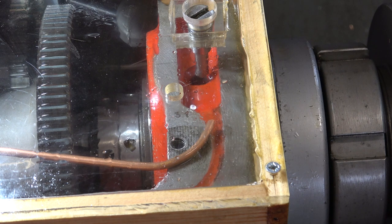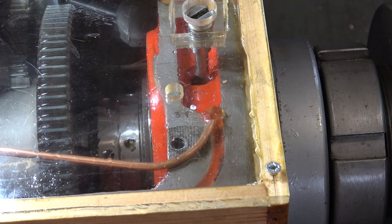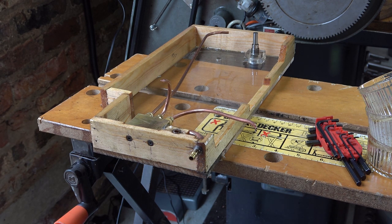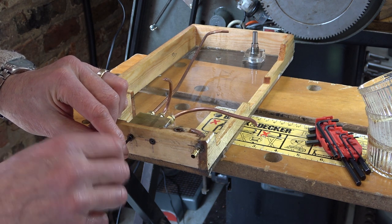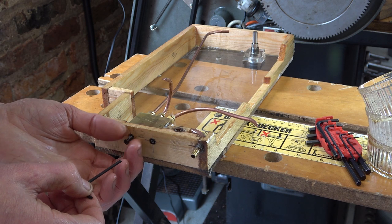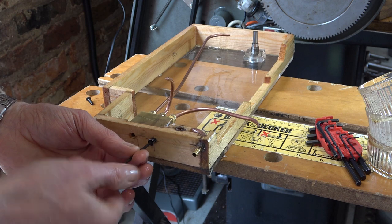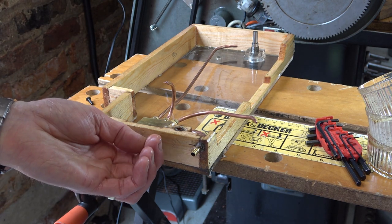One final test with the transparent lid now that the pipes are balanced with the gear pump — we'll see how much oil we get out of this front nozzle. I did have a look to see how long a tube in a peristaltic pump should last, and I saw 10,000 hours, but those are for the proper ones. I don't know about the eBay ones — probably 10,000 minutes. But I only use the lathe a couple of times a week, maybe for an hour or two, so I think it would last a long time. And if it did leak, all you have to do is change the silicon pipe — you don't have to change the motor. If it leaked, the oil would just run out onto the floor and I would see it before the gearbox ran dry.